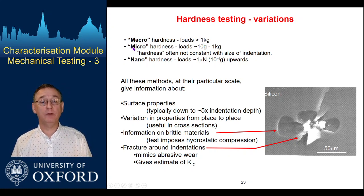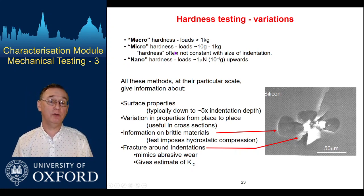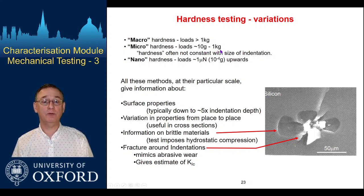If you want to go to a smaller scale to see what surface treatments are doing to your system, we go to the micro hardness scale — typically a kilogram down to 10 grams or maybe 5 grams. One thing that becomes apparent in this regime is that hardness as measured with an indent is not constant with the size of the indent. If you make indents with different loads at the sorts of sizes of a few to tens of microns across, you find that hardness is not constant even in the same material. So there is an indentation size effect.